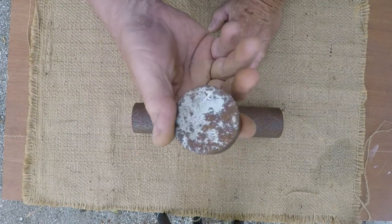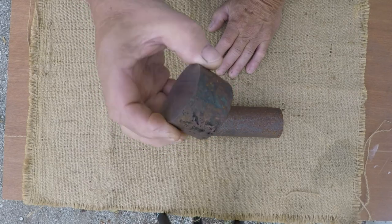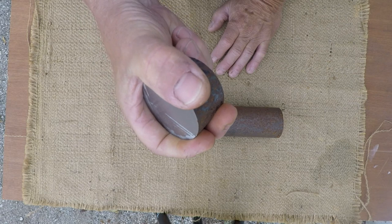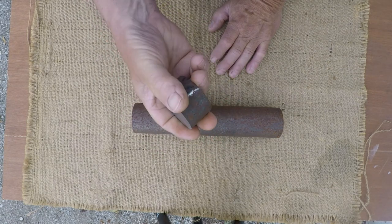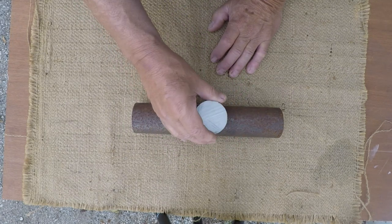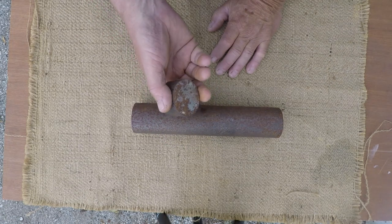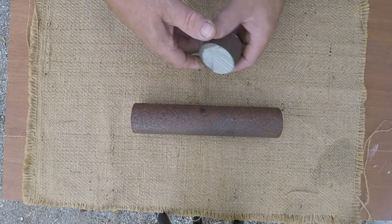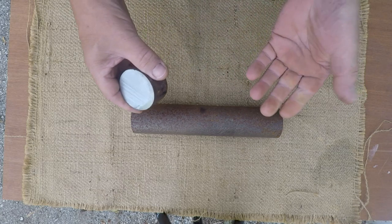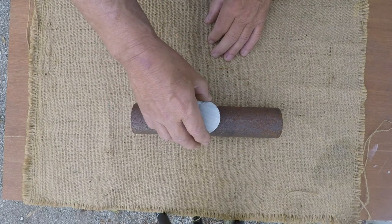Anyway, then advancements came in as they approached the 2000s, and it wasn't just General Motors. This steel requires austenitizing in heat and quenching. The entire auto industry went to cleaner methods, and they went to air-hardening steel for their dies, which a lot of my knife maker friends will know: you get it real hot, and as it cools off in still air, it hardens. So they didn't need large quench baths for dies and stuff like that. It changed the way they made their dies.